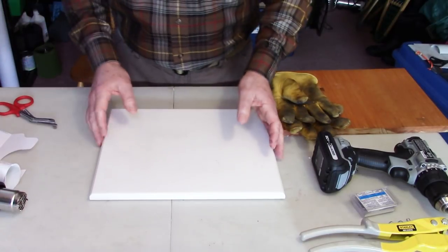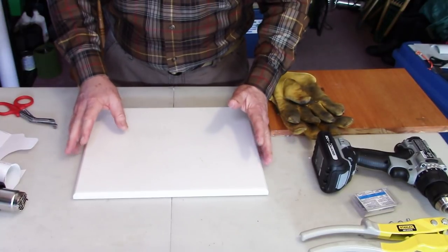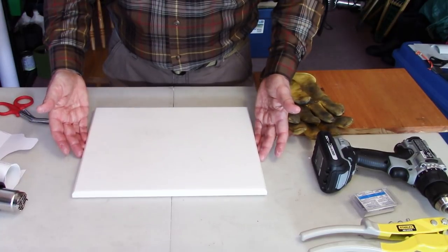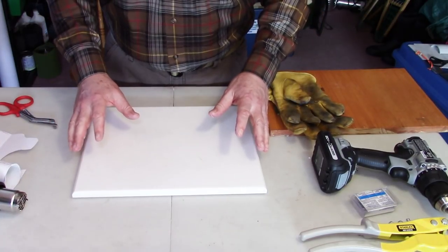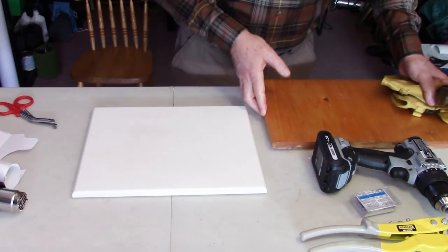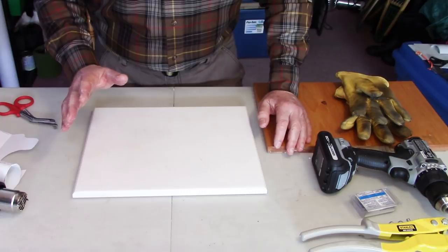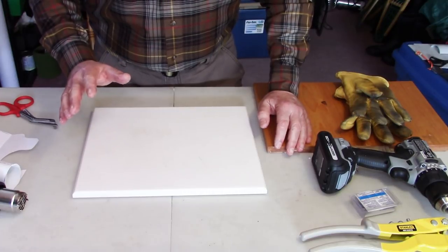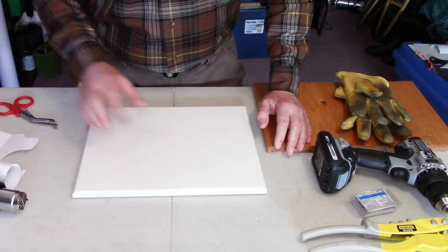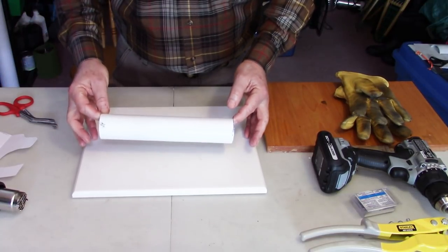Two other things I'm using: I have a piece of Corian countertop — an offcut from a project someone else had done — and it makes a great base. I like it right now because it's cold from sitting in my basement, which means it will cool down the PVC and harden it up faster. I'm also going to use a board for a press just to flatten it out. I made a homemade kydex press from two pieces of wood hinged together with foam pads in the center, but I found it doesn't work any better than doing it by hand for this type of project and material. So the first step is to take my PVC, heat it up, and flatten it out on top of the Corian board.